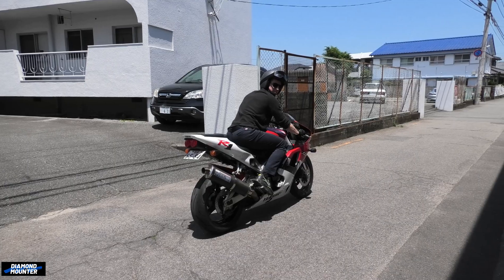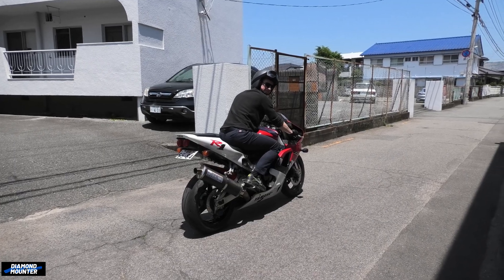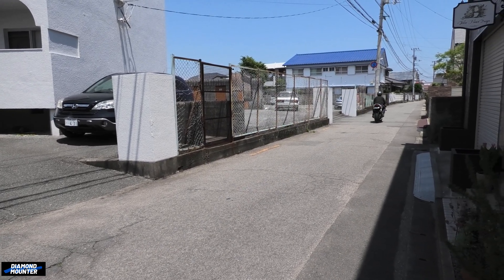I want to show that it's possible with platinum as well. It does wear out the charcoal a lot so you have to work quite quickly, but it's totally possible — even platinum with its really high melting temperature works fine even in charcoal. Okay, the Eagle has landed — welcome to Nao San's shop. She's just off screen doing some setting; I'm about to go to the back and melt some platinum up.